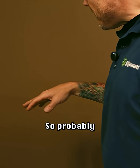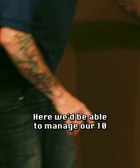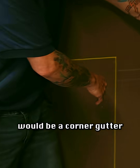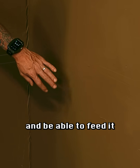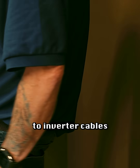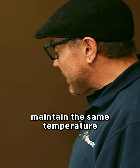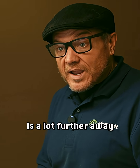So we can't put this battery above the other battery either. Probably the only option we have is over here, where we'd be able to manage our 10 to 12 inch distances for the corners. We'd use a corner gutter that would allow us to tie in the two inch knockout on the top of one battery and feed it through to the two inch knockouts on the top of the other battery and back over, accommodating all battery-to-inverter cables in two sections of gutter. The batteries would all maintain the same temperature.